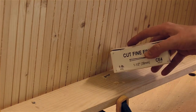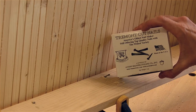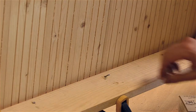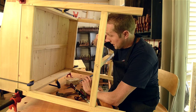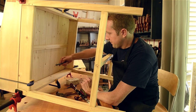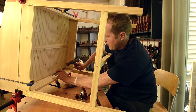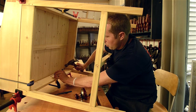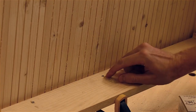I'm using these cut fine finish nails, one and a half inches long. These are the ones I've liked — I've tried different ones, but you can try any cut nails you like. This is just a historical style I really like. I'm placing it going with the grain. A nail set doesn't work so well in this situation, so I use a punch — a couple of punches actually. I like the fat punch for getting it down and then a finer one for setting it a little more.